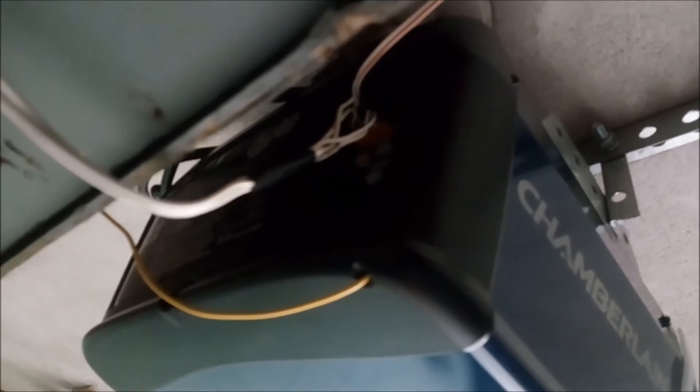We left about an inch and a half from behind. As you can see, there's a bunch of wires — the safety goes into the back, as well as the programming of the travel. You need to stick your fingers up there, so make sure you leave enough room for that.